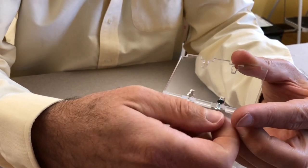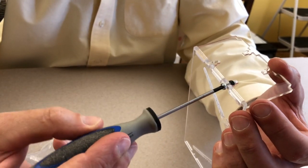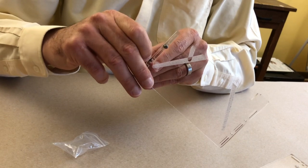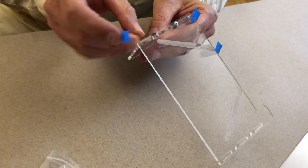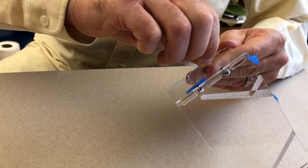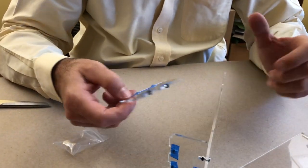Screw it in and it holds it tight. You don't want to pull this too tight because you'll end up cracking the acrylic — the nut will pull and crack it. The best technique is just don't crank it too tight. I find it easier to use a little blue tape to hold these nuts in place and then do them all at once. You could do them one at a time, but when you get into the more complicated robot parts where it's hard to reach all the little nuts, this blue tape technique really pays off.